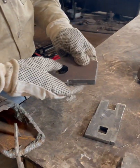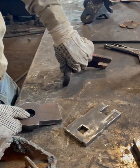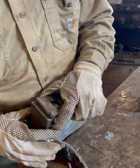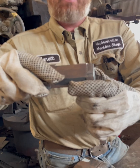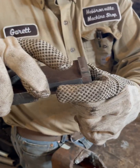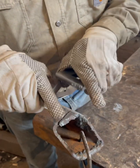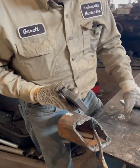We have our pieces here. This is going to be this one here. This is the one on top. All right. So a lot of people will take it and put it corner to corner and fill that up. Okay, but that leaves you a round finish. I don't like that. I want a 90-degree finish. So in order to do that, they have to come out flush. But can I just weld that like that? No. I have to bevel that. If I were to weld that up, just butt weld them together, well, I would need to grind my weld off to make it smooth. But if I did that, I'd grind my weld away and it would just break. So we have to bevel it or grind these corners into a V and put all that weld inside. That way I can grind it smooth and make it look like it never happened. So that's what we're going for today, okay?